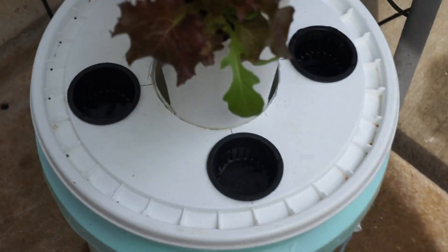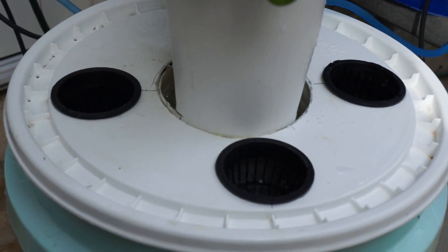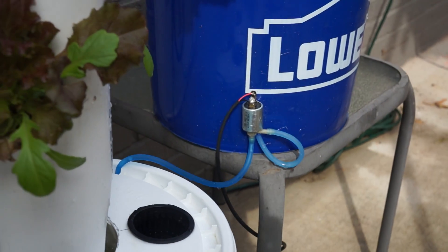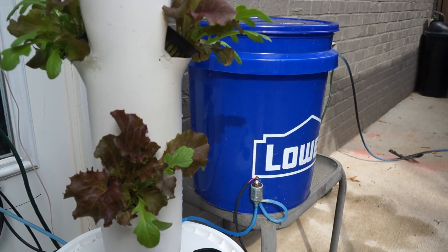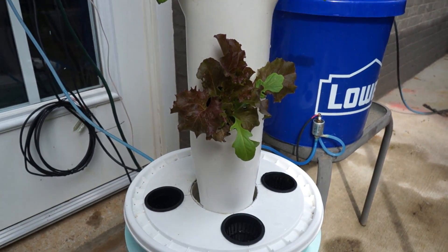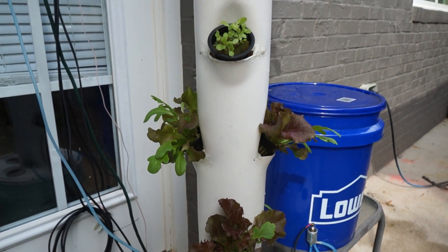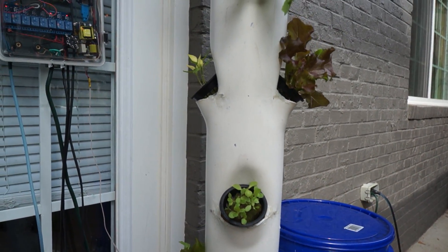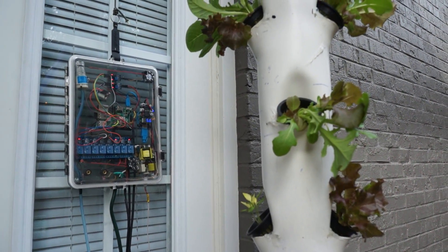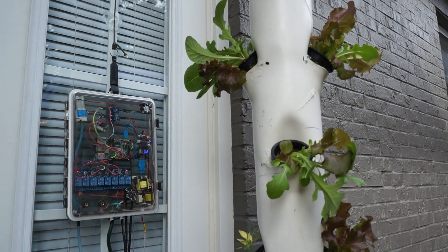I'm going to add some more plants at the bottom when they get larger. Now that I can control the water level, which is what this is — this is my reservoir. I took out the moisture sensor from the tower because it couldn't quite keep up. The Pi couldn't quite keep up. The state change between on and off as it was drying out flickered and it couldn't figure out what the end state was.